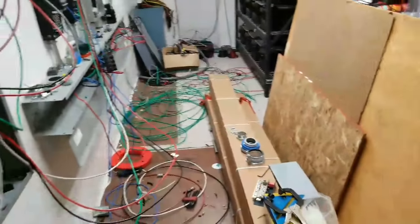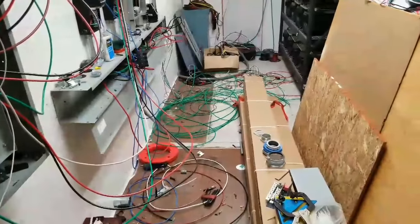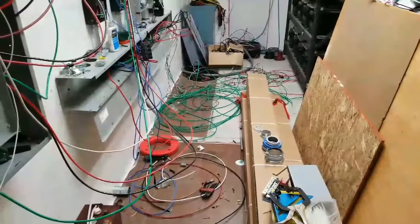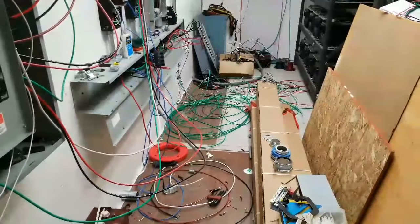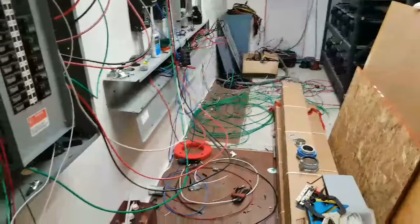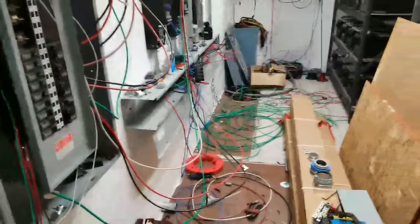We're getting there. You know, this is the hard part, is keeping stuff on while turning it off. And all that green wire you see over there on the floor is because I put a terminal bar in the can instead of running it all back to the panel and grounding it at that location. So, lot to go. Stay tuned.